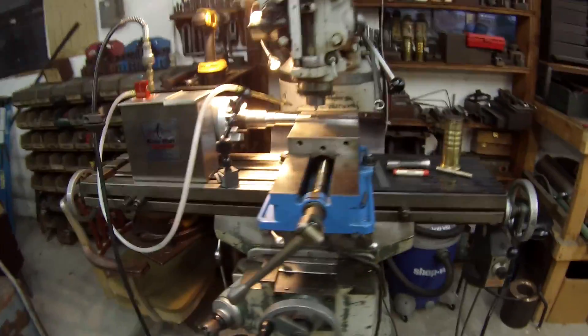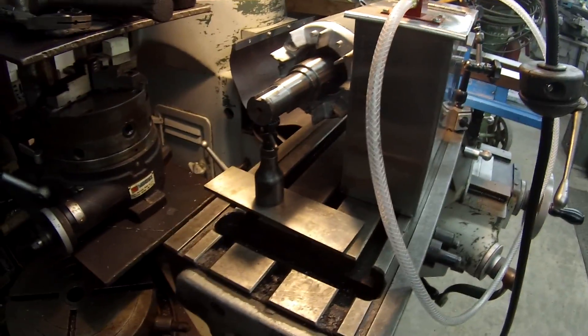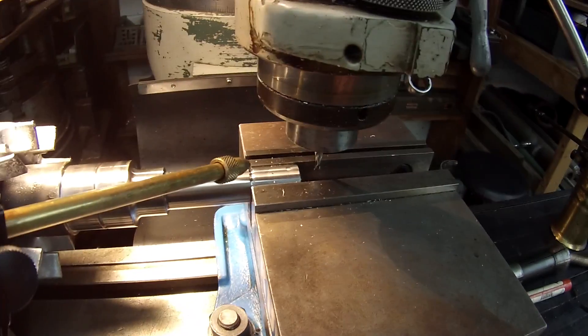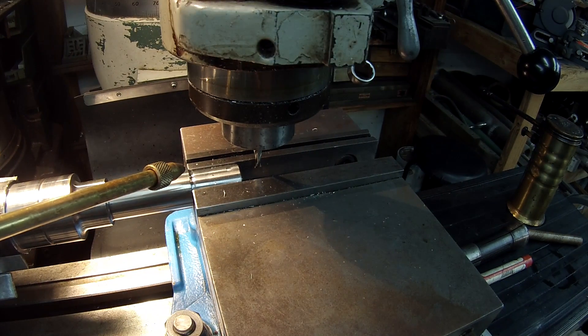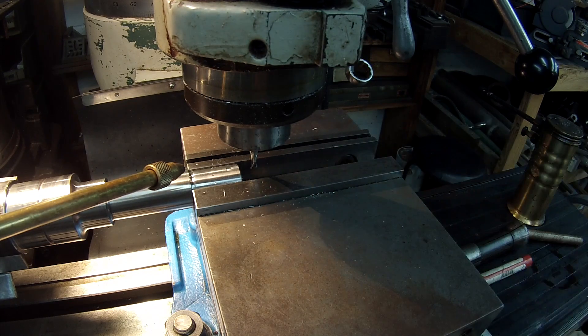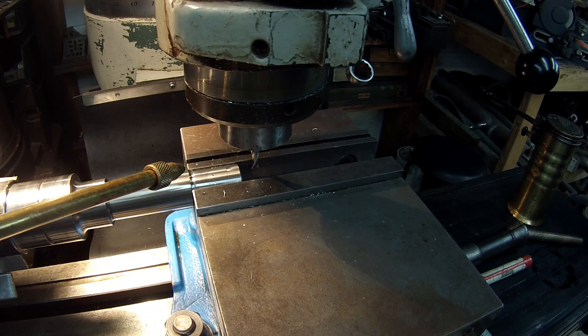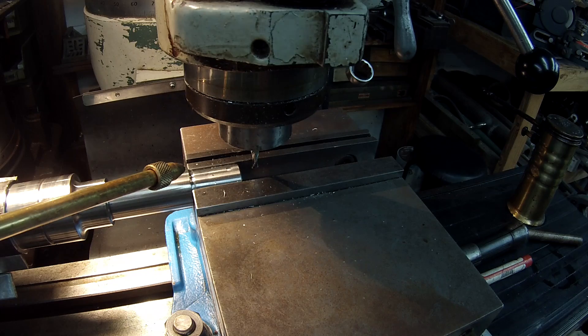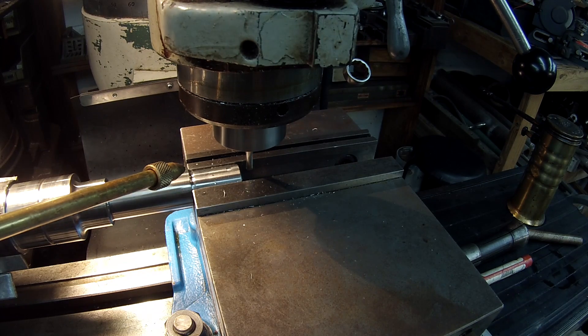The last thing I've got to do is go over to the mill — we've got a three-sixteenths keyway to mill in there. Here it is set up in the mill. I decided to use my machinist jack this time to get it leveled up — that was actually my granddad's machinist jack out of his box. I've already got the depth set, got it centered and the depth set on the end mill. I always touch off, find a flat where you can feel a little tiny edge on each side, and feed it up — in this case 0.093. I usually go two or three thousandths extra to give it just a little bit of clearance. So here we go, cutting it to that radius. Get some mist going.